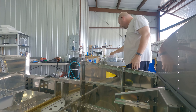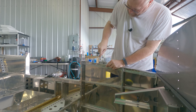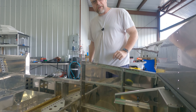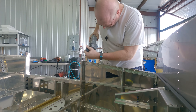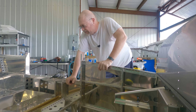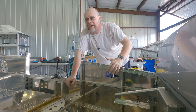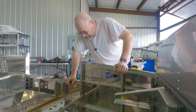If I've said it once, I've probably said it a thousand times: follow the instructions. I don't know if it seems really simple, but sometimes you just miss stuff. In this case, I missed putting these nut plates in - I should have done it a long time before now, and I'm just now putting them in. I don't know where I missed it, I'd have to go back and look at the steps. They need to be done, so I'm going to sit here and do it. Read the instructions and make darn sure that you do the entire step before you move on to the next step. And even then, when I try to do that, I still miss stuff. This was another one - I just missed a couple nut plates. You always find out later down the road, you're like, hey, these nut plates aren't here - guess I better put those nut plates in.